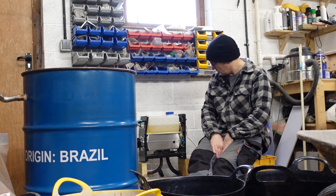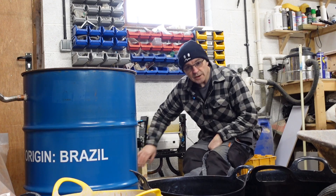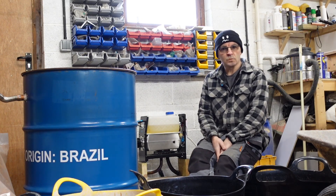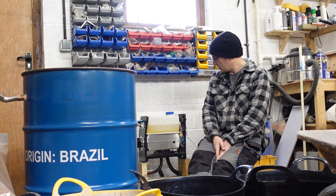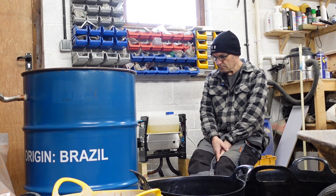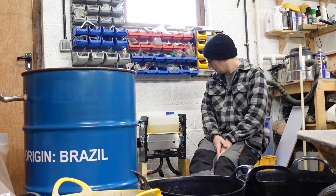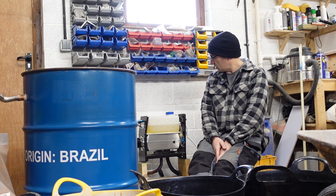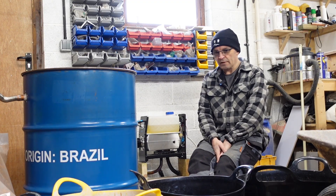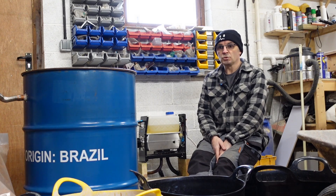I had this sneaky suspicion this wasn't going to work. When I did the flanges it just didn't seem to get as hot - normally you can just about hold your hand in front of it. I didn't run it for that long and I thought oh it just hasn't been on long enough. The combustion temperature peaked at 167 which again I put down to short run time - but I should have known. In the back of my mind something was telling me it's not going well. The soot caused a restriction. It might just be the pipes caused the restriction. Running it on low doesn't help, but I don't want to not run it on low because the clicking's annoying. I'll chalk this up as a fail in progress.